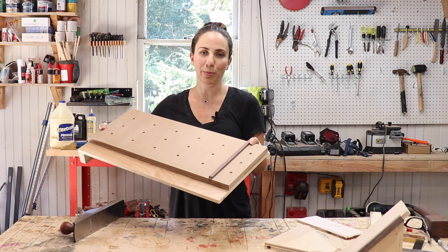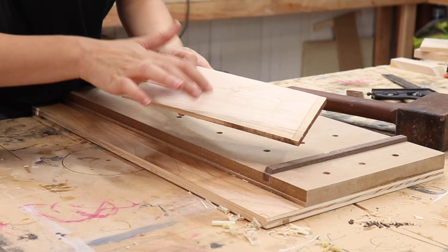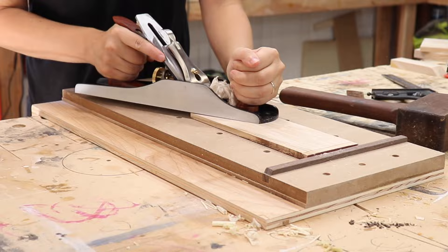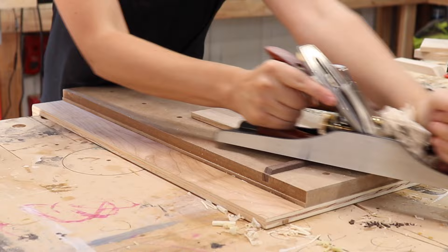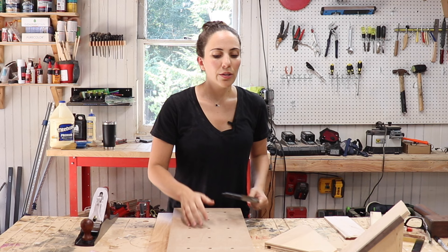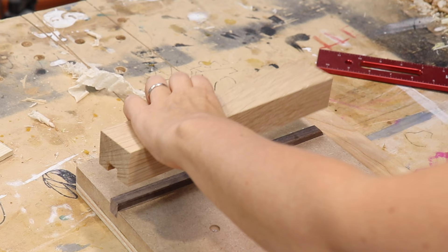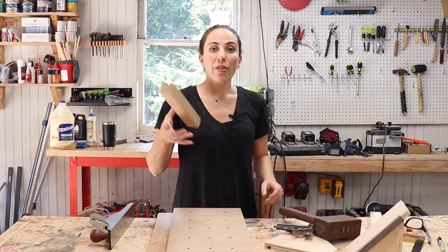The second feature is the skinny fence, which serves two purposes: holding all the attachments, and planing thin stock. I have a piece of maple that I resawed with saw marks on it — the thin fence lets me plane the full length of that board with full support. The second reason for the thin fence is that by setting it into a dado, it's perfectly square, meaning all the attachments will be square as well.